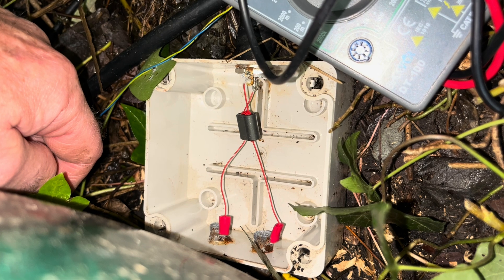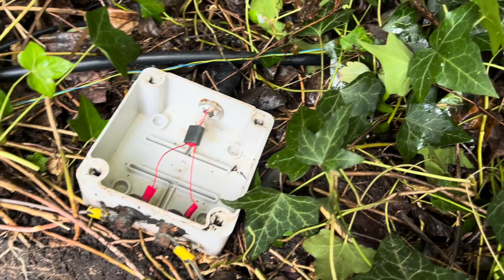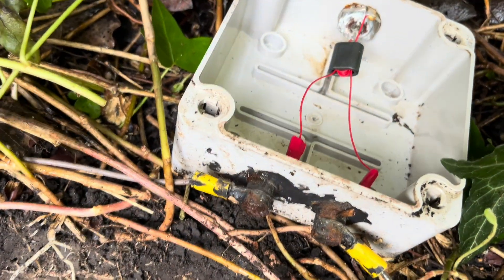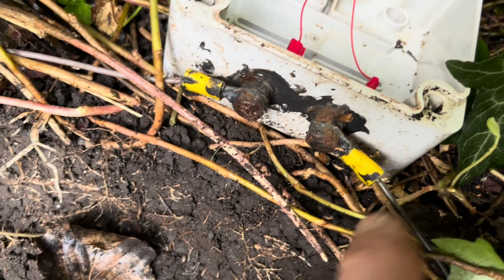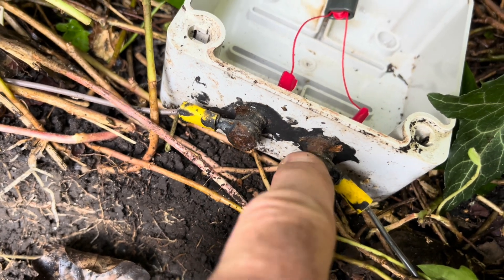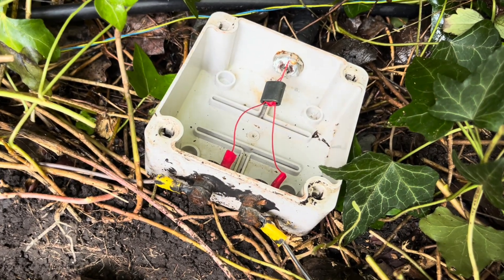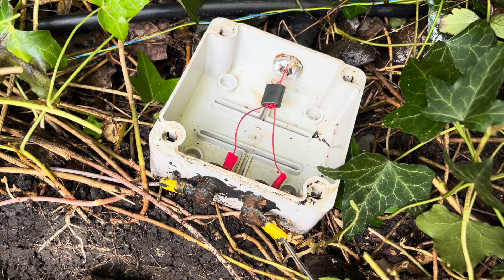So I'm going to have to wrestle this box out somehow and disconnect it. I moved the tree — it was only rooted a little bit. So here we are, you can see what's going on now: the moisture has got to that SO239, although the liquid rubber's still there. These have corroded — they were obviously not stainless. So I'll take the whole box out and see what I can rescue and what needs redoing — a lot of it by the looks of it.